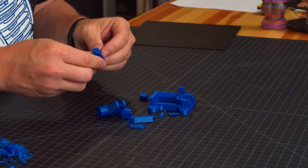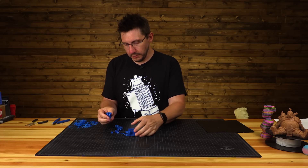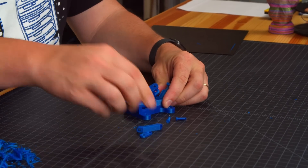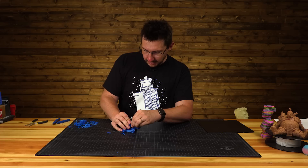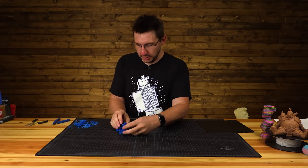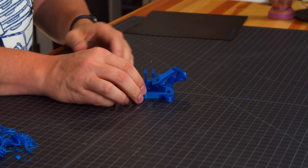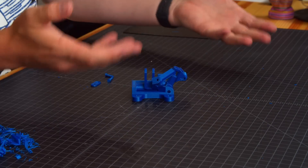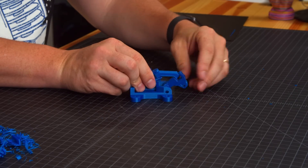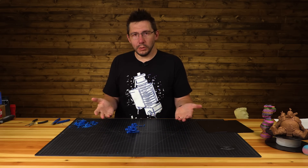The concept of this is fairly simple in looks, but it's an engineering marvel. This piece goes in here, this goes this way, this goes just like that, and then this piece goes in the middle. So it translates this motion to this motion — when it's like this the latch is disengaged, and then as this moves, it translates the motion right there, and then that piece is down, locking the door into place. If you have these all over the door, then it works a treat.